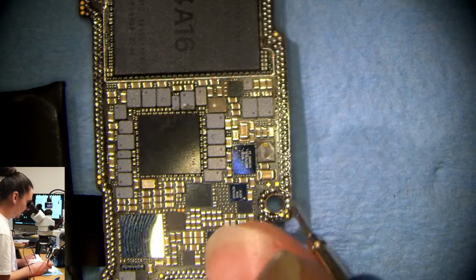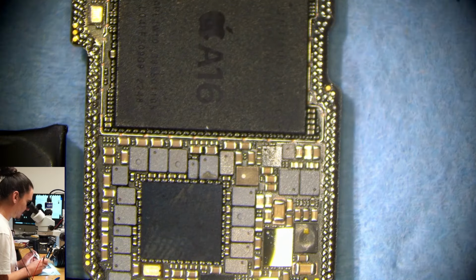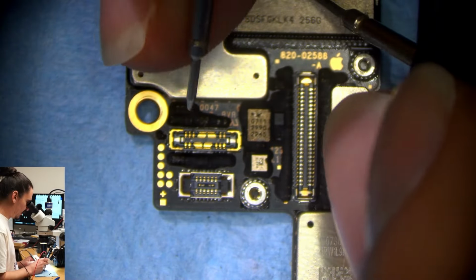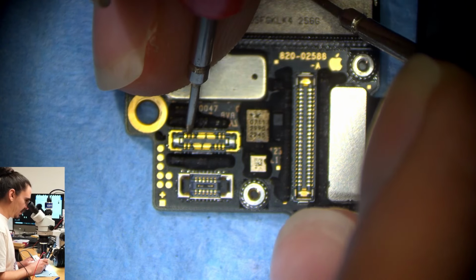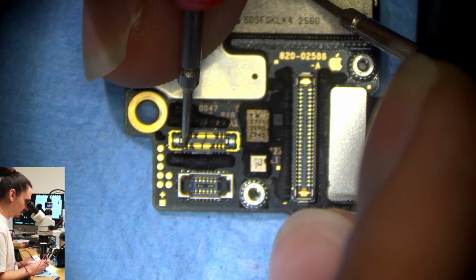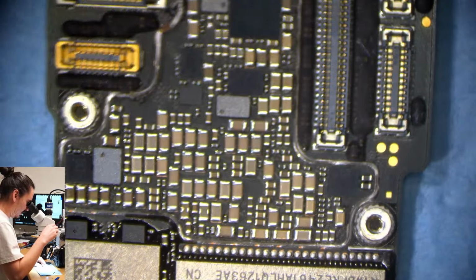I'm curious if I'm getting RAM voltages. And I am not. Okay. Check for 1V8 voltages. Actually, I'll just check for my voltage on my power button. That's 1.38, and I'd expect 1.8 there, actually. So it's a little low. 1.45 now.